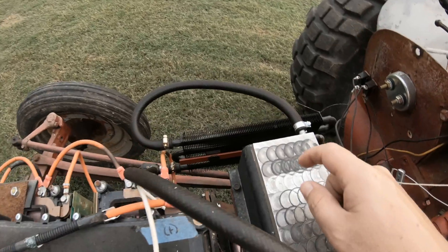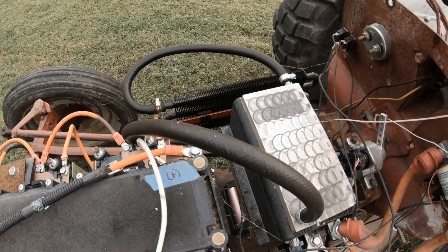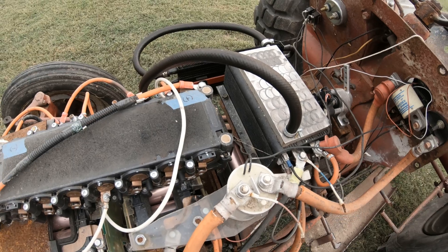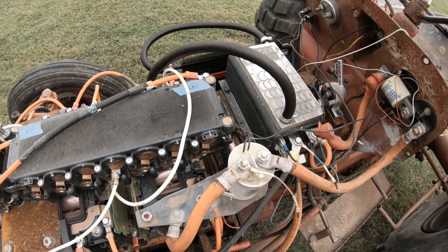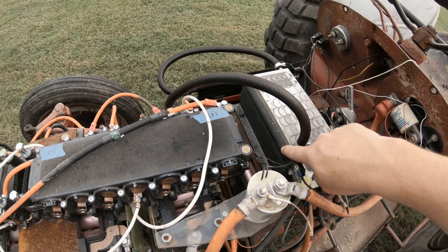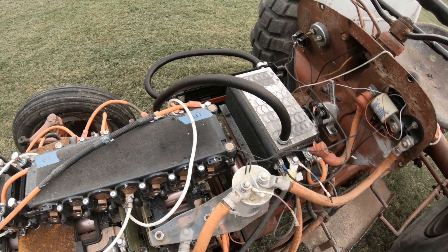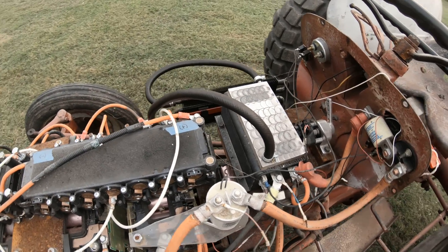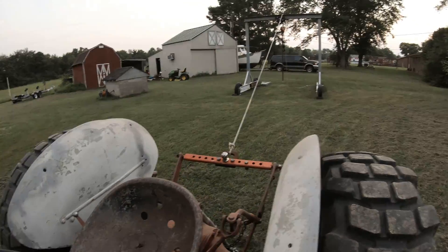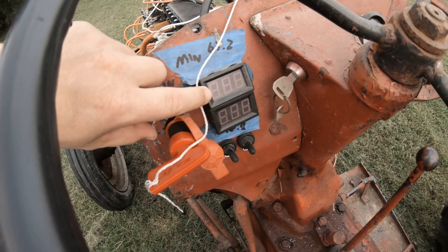I realized it actually was not overheating as much as I thought. It certainly gets hot, but what I noticed was it's actually an overvoltage on the battery pack causing the issue. What happens is it runs poorly and starts cutting out the first couple of minutes, then does awesome for maybe 20 to 30 minutes — just perfect — and then it starts getting hot to the touch and I believe we're getting thermal cutout. If I let it sit, I can repeat that cycle, getting maybe 15 to 20 minutes of use, for hours — probably two to three hours total — but again, that's just hobby stuff, not bush hogging.